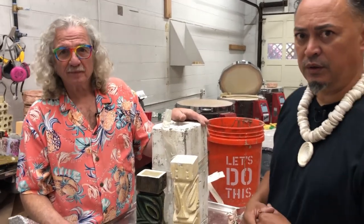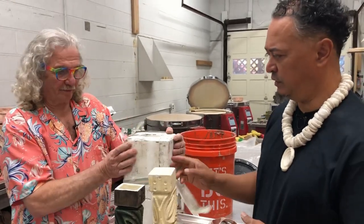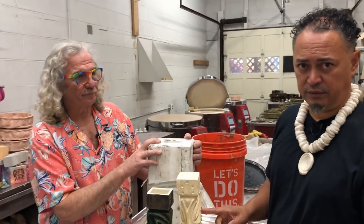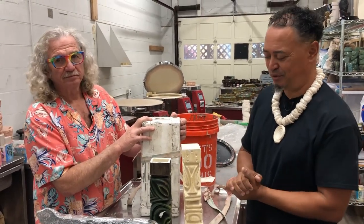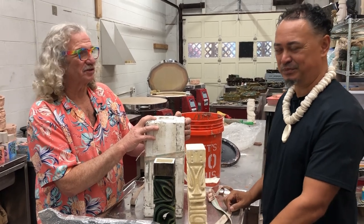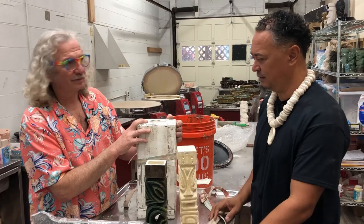So when you create the mold for this, the mold is also plaster. The mold is plaster, correct. So you have to seal the plaster skull in order to make the mold, otherwise you'll have a big block of plaster. Right, okay. Gotcha. I've made that mistake. That's why I was asking. Right. And do you use soap for your separator? Yeah, I soap it up.